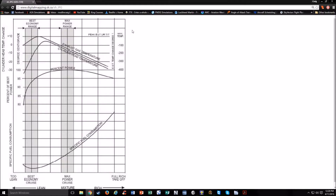So now talking about exhaust gas temperature — this Lycoming power chart will show you what happens at different EGTs. This top line here is your EGT, and these numbers over here are your differential from EGT — your EGT temp change in degrees. When we lean to where the engine runs rough and push it back in, you're going to end up at your peak EGT, which is right here. That gets you towards your best economy range, and your specific fuel consumption goes down — that's why it's the best economy.